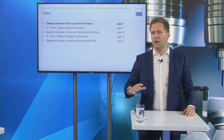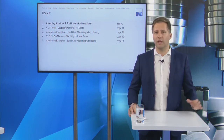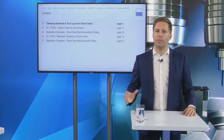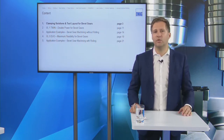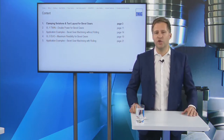If you only need four tools and no rolling process is required, the VL1 Twin is a very price-sensitive product. Secondly, our bestseller: the VL3 Duo. The duo concept features two working areas — two spindles with two turrets that can work independently, enabling OP10 and OP20 on one machine. For bevel gear production, we also use the VL3 Duo as a twin machine, running OP10/OP10.